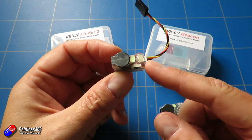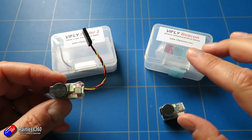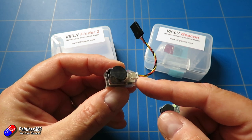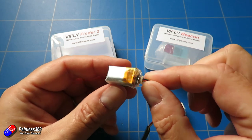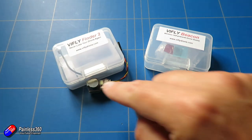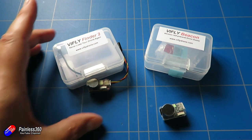So this one is really all about flight controllers, and that's really what I want to talk about here — the difference between the two and where you'd use one over the other. So if you have a flight controller with a standard buzzer pin output, then this is the one you want if you want a louder buzzer, a flashing LED at the same time, and a battery backup so it continues to sound even if the battery gets disconnected. Particularly handy on smaller quads that might disappear in the grass.